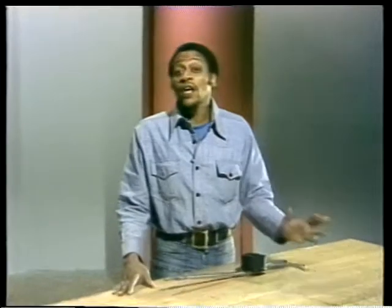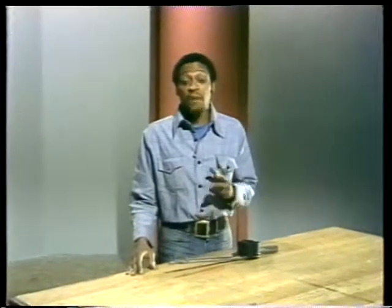The best policy is to use every bit of information available to find out about a bearing or any piece of equipment you're working on. Learn how to diagnose the situation — figure out as much as you can about a problem before you start to take the equipment apart. Find out what it's like when it's working right so you'll know when something's wrong. Take some time now to review the information on diagnosing the operation of a bearing, starting with the three major indicators: temperature, vibration, and noise.